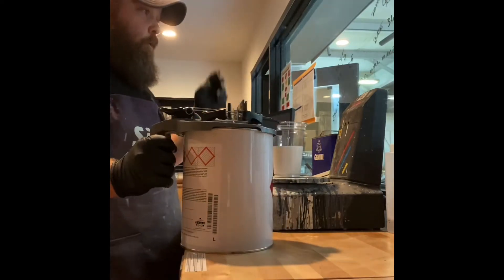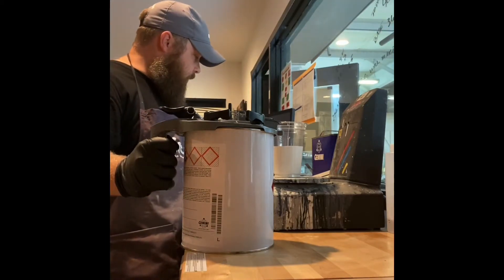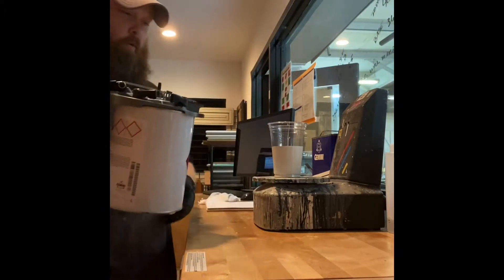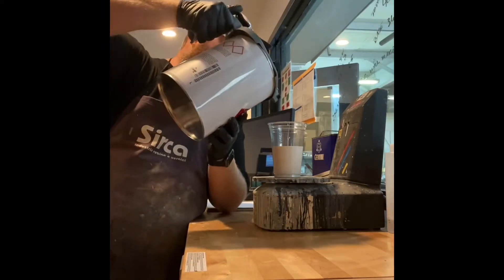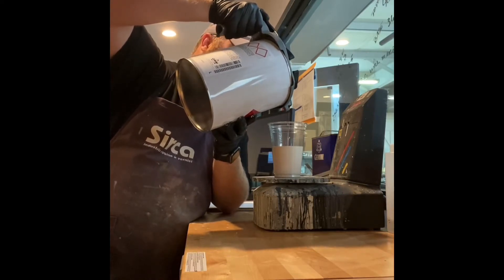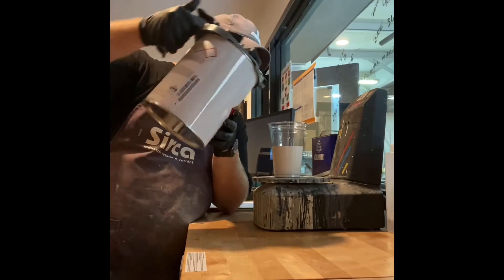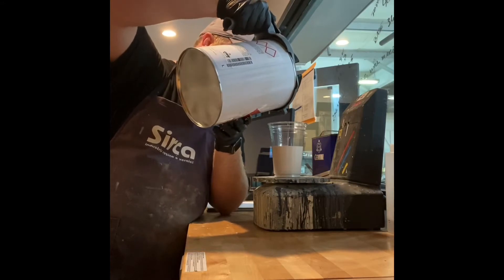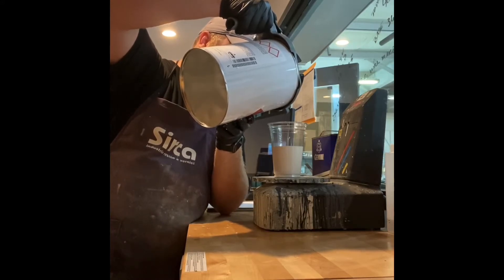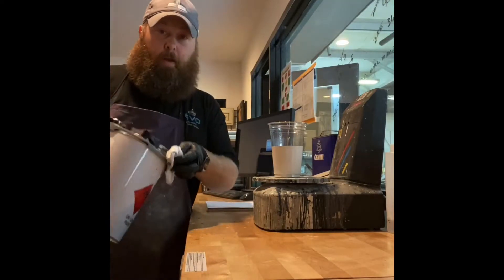My scale is reading 337.6 and I'm going to add 5.7 to that, so 337.6 plus 5.7 equals 343.3 — that's where I need my scale to go. I spin it, get it right up front, open my tip slowly, and just keep an eye on it. I'm at 341... slowing down... 342.6... almost there. We're at 343.5 — it's kind of rolling once it settles. Black's in.